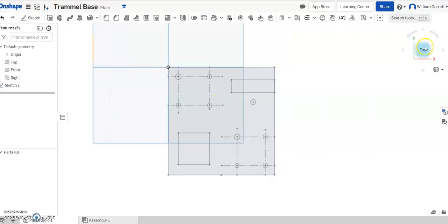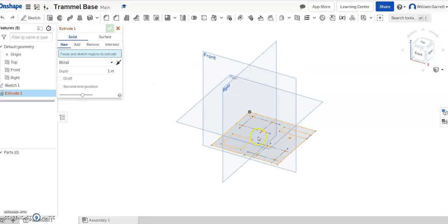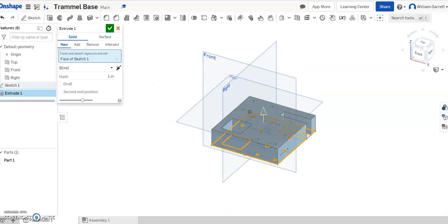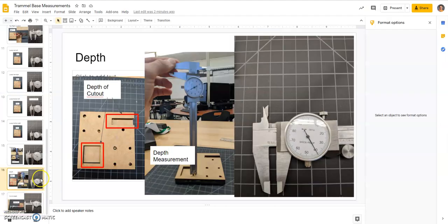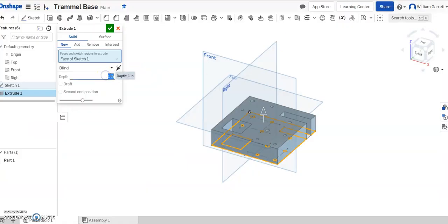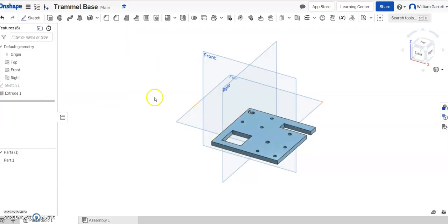So I'll hit the green check to accept. Then we just need to extrude — I'll click inside my large object and set our thickness. Looking at the depth measurement, the upper portion is about 0.240. So I'll type in 0.240 for our extrusion distance. That finishes the top portion. In the next video we'll look at making the bottom portion. Hopefully this helps a little bit — good luck.